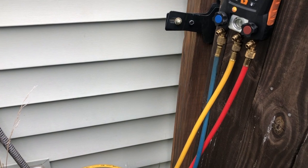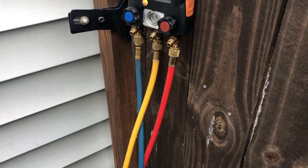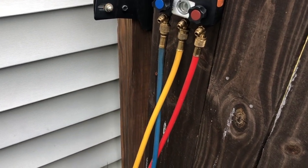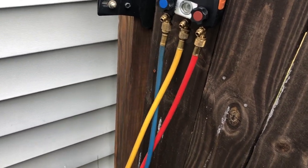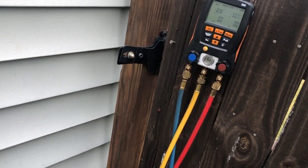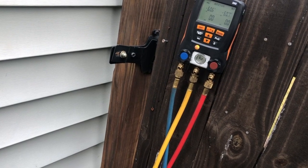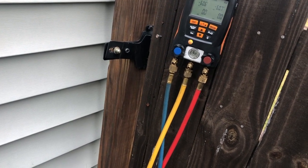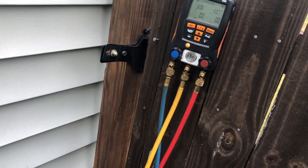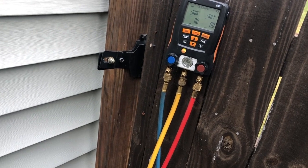It just depends. I'm going to go up there and see my setup so I can take out that evaporator, and I want to open up a side to keep it open. I still have to pull a vacuum, but I'll keep it open so that when I put torches to it, I won't have a problem. I need somewhere for that to be able to escape. So there's no pressure in there, but I don't want anything building up, so I still have that flow.